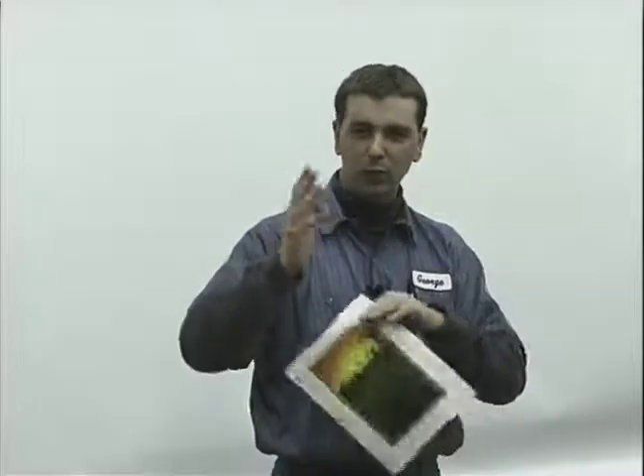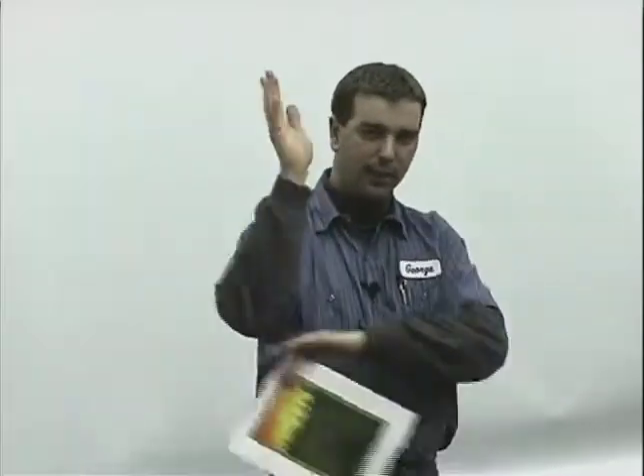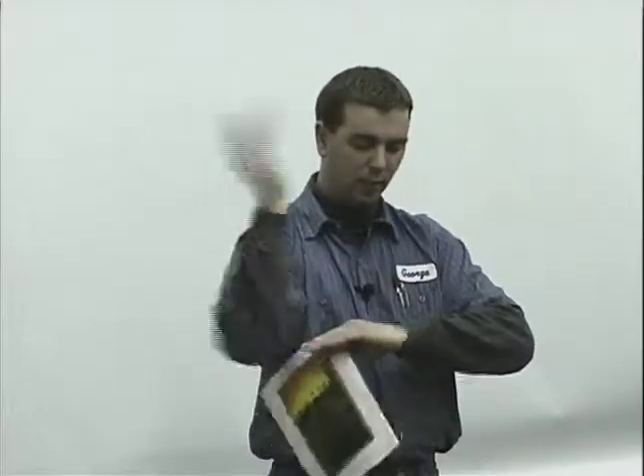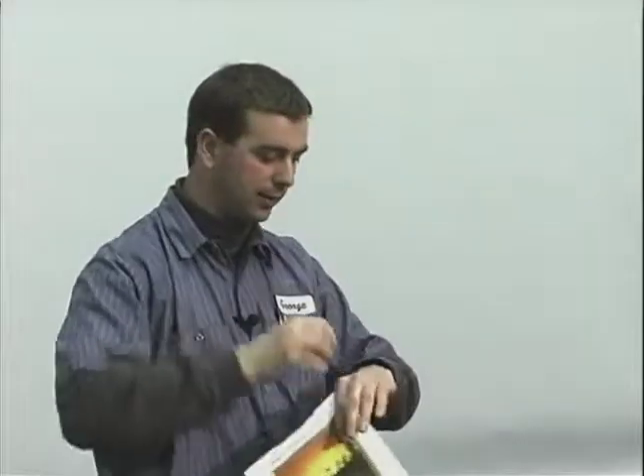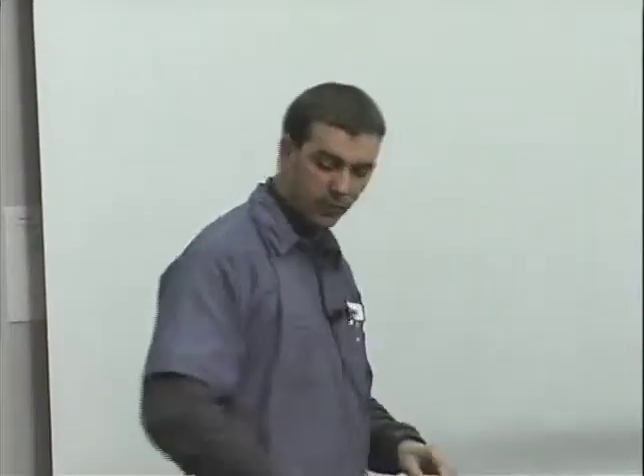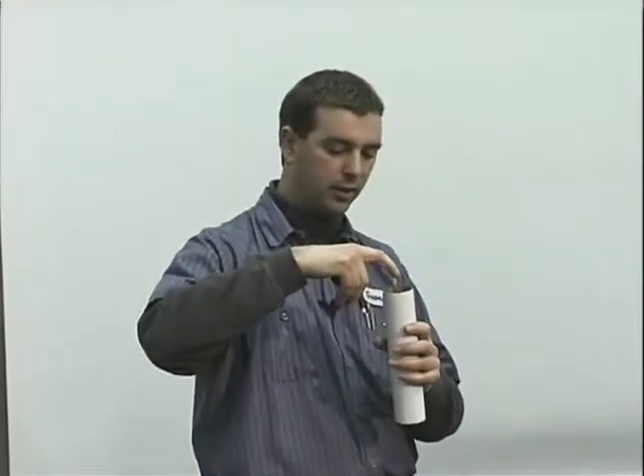I had another guy come in and give a presentation. He had a little special tool — it had like a mousetrap. You'd put a blob of grease on it and the mousetrap would come and smack it. Most greases splattered out, leaving almost no grease between the surfaces. His grease, when he did that, didn't actually splatter out, which is good — it's a sticky grease. When you play with his grease it was similar to this type here, and we call this the super sticky grease.